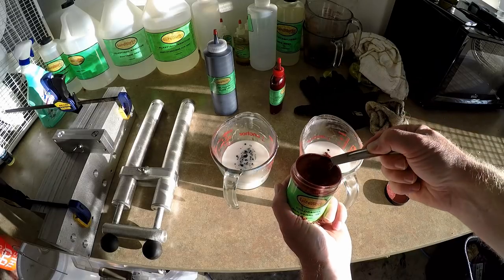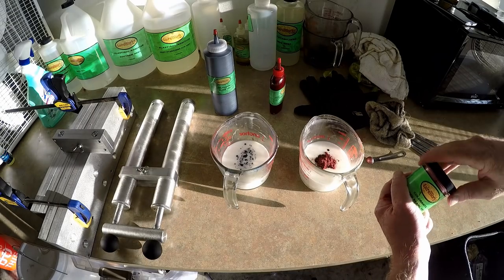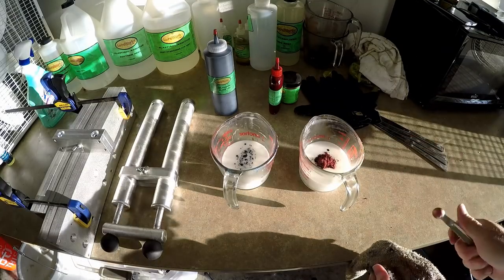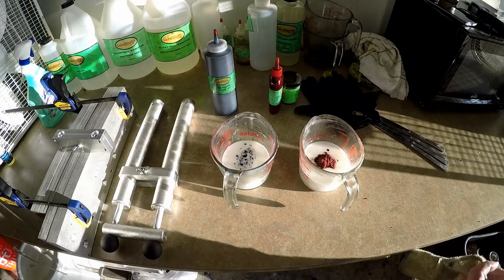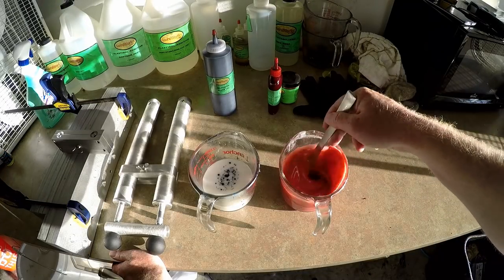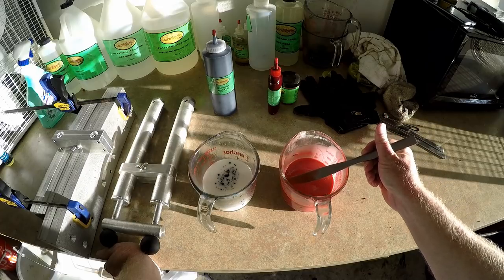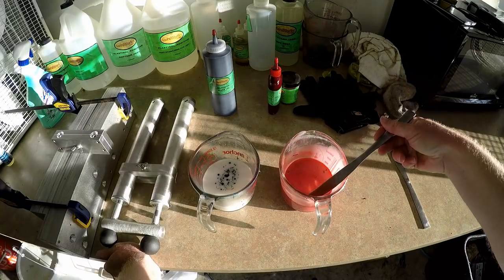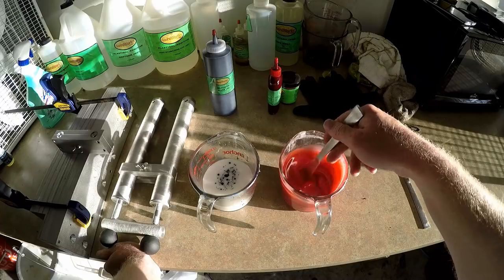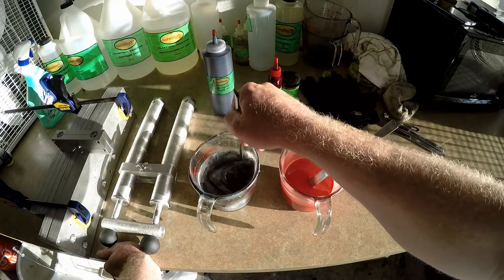Why not a little more for good measure — we'll see what that gets. I don't want transparency here. Most red shad, if I'm gonna try to make it like the big manufacturers, it's a very thick color — both sides are very thick, there's a lot of contrast, they don't really blend together much. One thing to remember when you're using pearls: the powder will try and clump together. You really need to stir a lot — it kind of requires a lot of stirring, probably more than you want to do, but it's a necessary evil for sure.